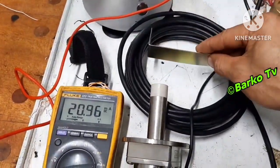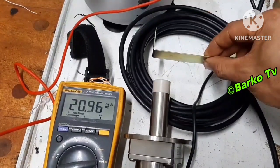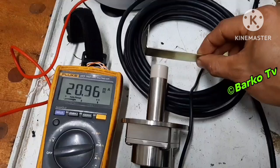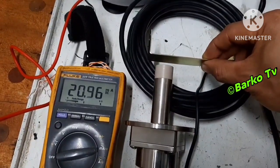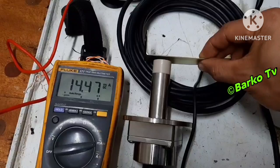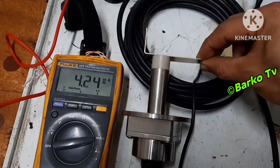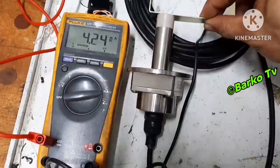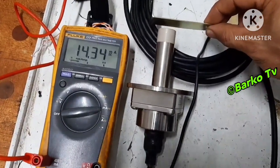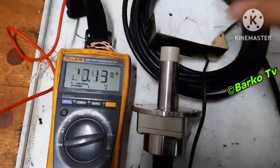There is no object detected right now. If the plunger hits the sensor at a certain distance, 20 milliamps is the maximum and 4 milliamps is the minimum. 4 milliamps is actually hitting the sensor — this means the sensor is good.